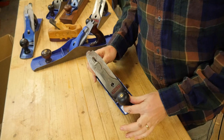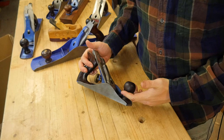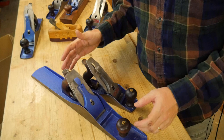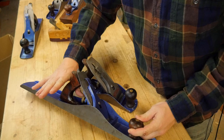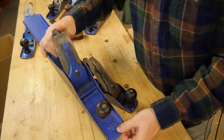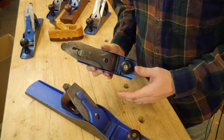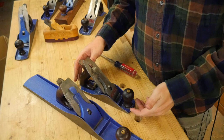I'm not going to go into all the different types and sizes of hand planes — I'll do that in another video. Right now I just want to talk about the Bailey pattern and how it is shaped. Throughout the years a few adjustments and changes happened, but mostly they're all basically the exact same thing. Some of the stamping differs — this earlier one I think is a Type 6, so it doesn't have Bailey on the front, but later ones have Bailey cast in. You can also tell the age by patent stamps and other markings. I'll leave a link to a site where you can look up how old your tool is. It doesn't matter what size — a number three, four, seven, or up to a number eight — it's still a Bailey pattern.